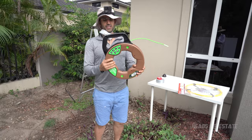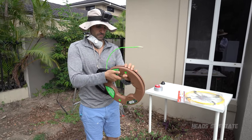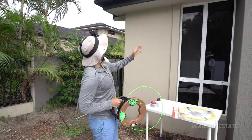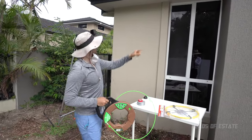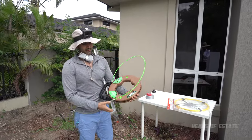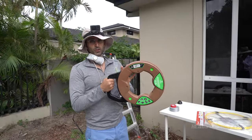So previously I've been using this sapphire fish tape. And the problem with this guy is it really coils up. Let me just give you an example. Straight up, it's not rigid. So it may have worked for areas like these parts where it's a bit of an open cavity straight into the attic. But for this corner here, where all the planks of wood are really cross-sectioning up, I couldn't find a way to fish this through. This one's probably best for running it through conduit.